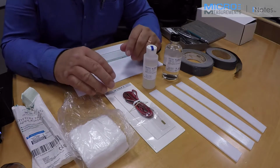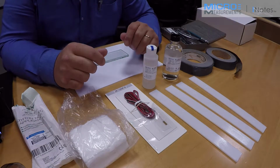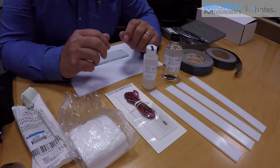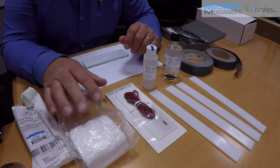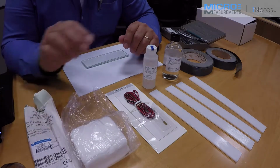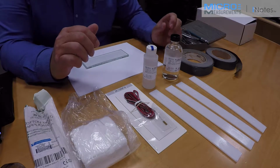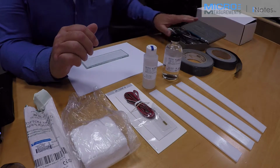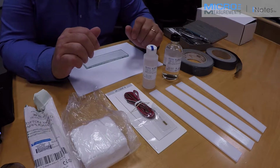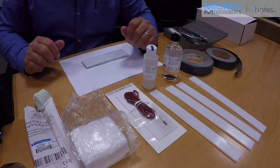We're going to be using a CEA series strain gauge today because plastics are sensitive to heat. We're going to use a pre-cabled gauge so that we avoid the heat of soldering. For our wiping and cleaning processes, we're going to use some surgical gauze, some cotton-tipped applicators. For surface abrading, we'll use silicon carbide paper, and I'm going to use the ATS-2 tool set, some of the tools out of that. And then we're going to be doing a checkout using our P3 strain indicator recorder.